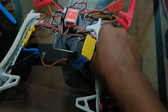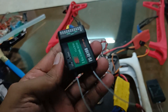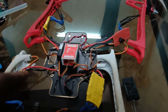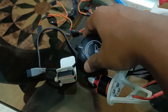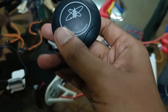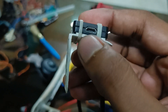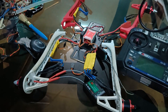These are the cables that connect the flight controller with the receiver. The drone board is fully cleaned — it took me around two and a half hours. I am going to use a large 10-channel receiver this time, because I plan to later attach a dropping system and camera gimbal, which need extra channels. The previous six-channel small receiver has been replaced. There is also the third-party M6 GPS module and the LED light module with a USB programming cable.